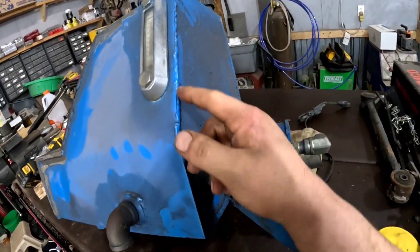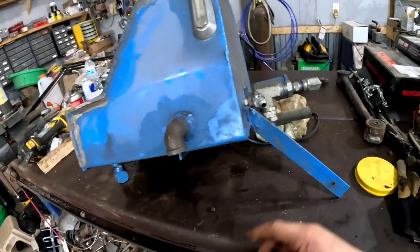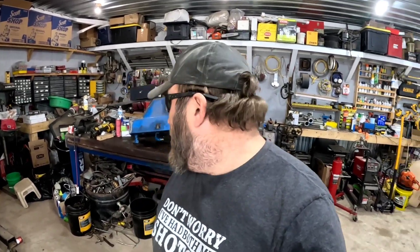So there's been a lot of refabrication work — redoing all the seams to make sure they're not porous and leaking. There's a bunch of hydraulic stuff that needs to be reworked. The filters were being bypassed — they had two massive hydraulic filters on this thing and some of the hydraulic oil wasn't even going through them; it was just directly bypassing them.